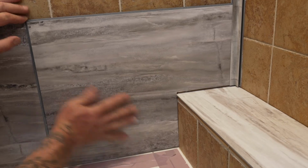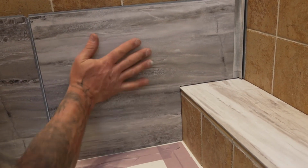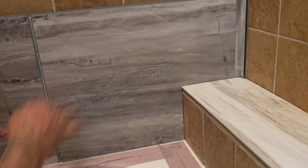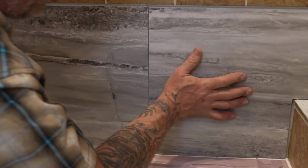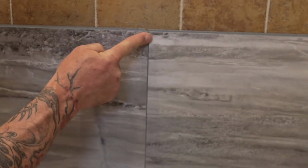When pushed into the trim entirely, the interlocking edges will be exposed. Push the tile into the corner trim until it can lay flat onto the substrate. The tile can now be pulled manually back into place. Pull the tile toward the interlocking joint until it is tight.